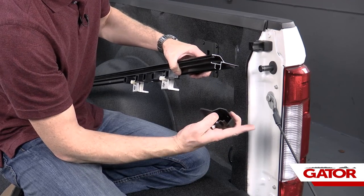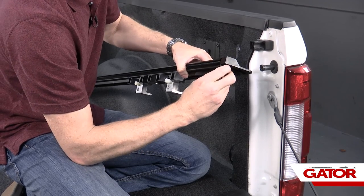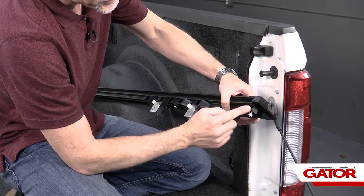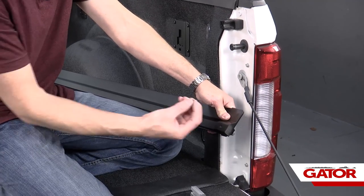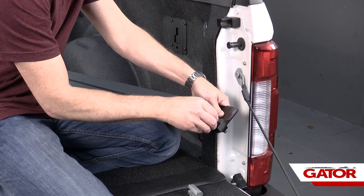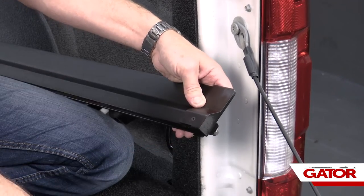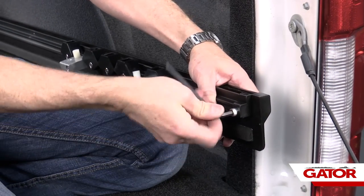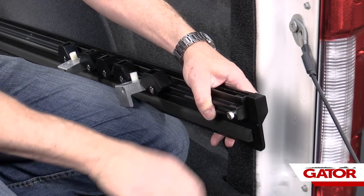Now that we have all the latch assemblies and the clamps in place, we're going to go ahead and slide the end cap into place as well. Once the nylock slides into the end cap, we're going to go to the top side of the end cap — there's a little hole that lines up to the hole in the rail. We're going to take our 5/64th allen head screw, it's a very small screw, and put that into the end of the rail. Once we thread that in place and get it nice and snug, we're going to take our quarter-inch allen wrench and tighten down the end cap. We don't want to over-tighten this — we only want to get it to about 5 foot-pounds, just snug.